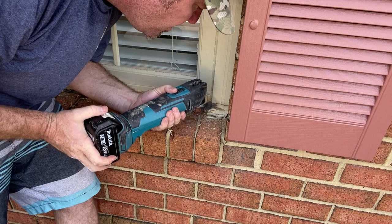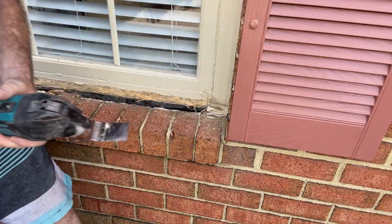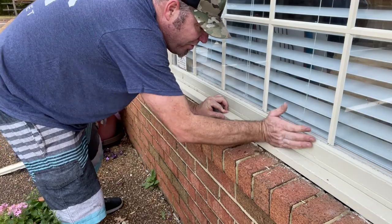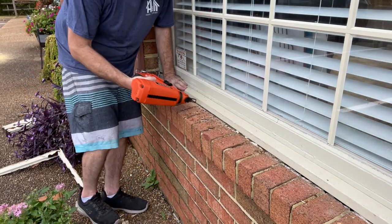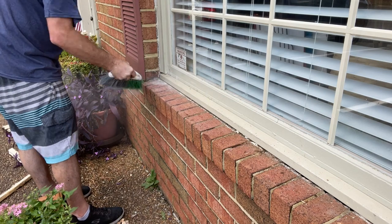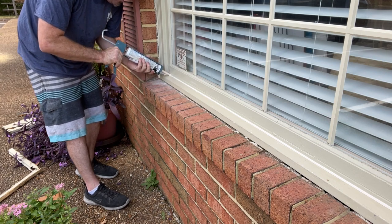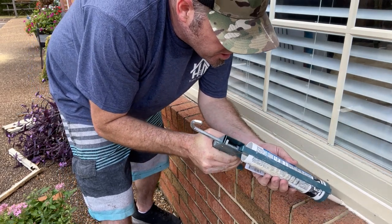One of the greatest things I've experienced as a dad is going to school with my child. This is something they'll remember, so if you can get the opportunity to spend a day in class, you should take it. Once you know your sill fits up flush to the window — not only is this wood replacement job provision for the family, I got the honor of being the guy to fix up the school. Echo is really proud of me and gets to talk about me in class. Now let's get some door and window sealant on it. The trim isn't rotting off the building anymore. I'm gonna caulk it to the brick but be a little more gentle with the caulk because it's hard to wipe off. Make sure you get it good and sealed.